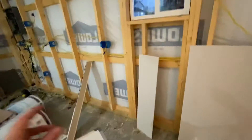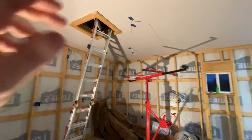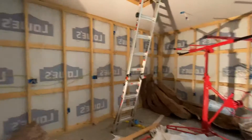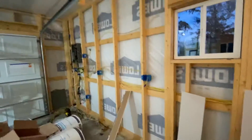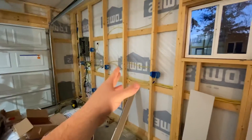Been messing a lot with the wiring, trying to get everything how I want. Basically I've come down to having a few of my outlets — like my miter saw, mini split, air compressor, etc. — all on their own breaker, own wire, just one outlet per breaker for those. Other than that, I'm splitting my walls north, east, south, and west, and then splitting them into two.